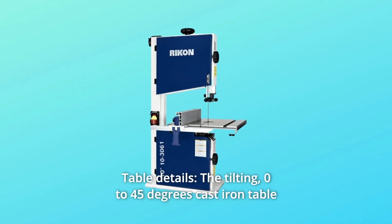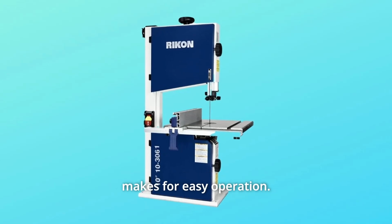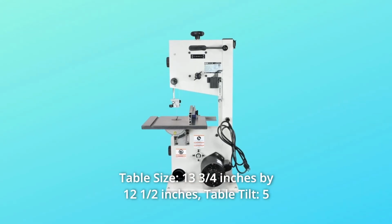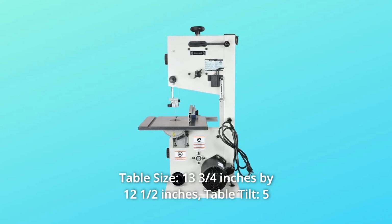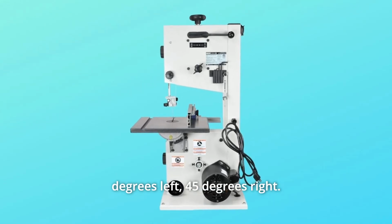Number 3. Table details. The tilting 0 to 45 degrees cast iron table makes for easy operation. Table size, 13 3/4 inches by 12 inches. Table tilt, 5 degrees left, 45 degrees right.